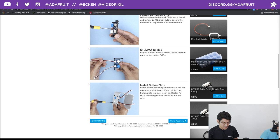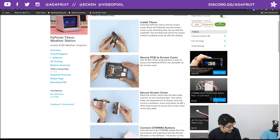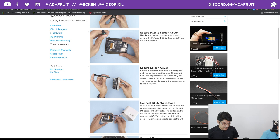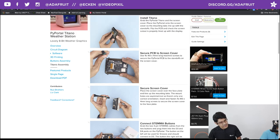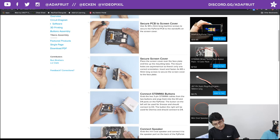The separate button piece also adds stability so when you press it, it's nicely secured and not floppy. The Titano doesn't snap fit directly — it has mounting hole tabs, so I'm using M3 screws to secure them into built-in standoffs. The screen cover gets secured to the face plate — that gray-colored piece with the chunky bezels in the front. I opted for screws there because there's plenty of room for screw tabs. I added screw tabs so you don't see the screws from the outside.